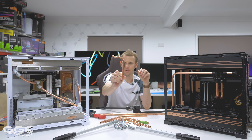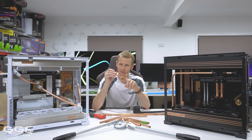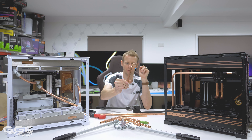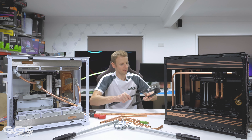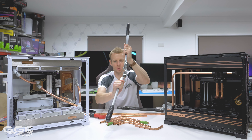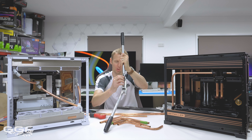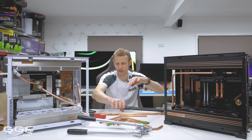As you can see, there are very minimal imperfections on the ends after the bend. I found that with this build there were a few little imperfections when it starts and when it finishes. But this one actually came out really good - that might be the difference between the slightly more expensive one and the cheaper bender. One thing you want to make sure of: you don't want to nick or scratch the inside where this runs around. I actually put some Vaseline in here to help it grip, and if there was any dirt it would probably slide along with it because I didn't want to get any scratches in there. So that's basically it on how to bend it - not too hard.